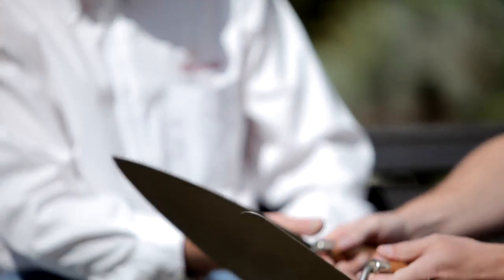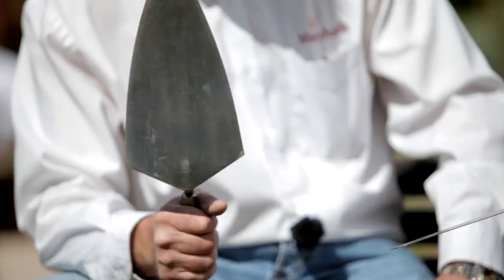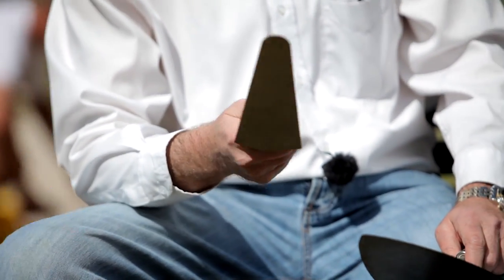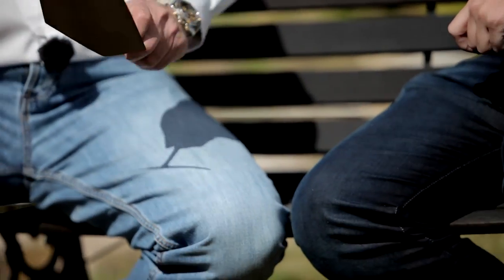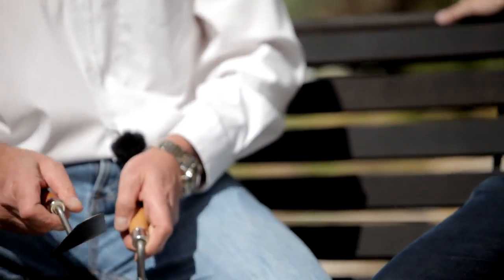These are the tools of choice. We've got a bricklayer's trowel — this is obviously for brick laying. You scoop up, lay the bricks, down they go. There are all different types. Any reason for the different sizes or shapes? It's the tool of choice — specific bricklayers like specific tools. If you're doing smaller, intricate block work, you'll use a smaller one to get more into detail. The larger one is for basic brick laying where you're doing long runs — you get more done.